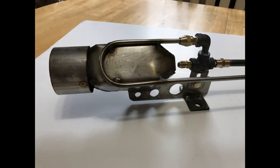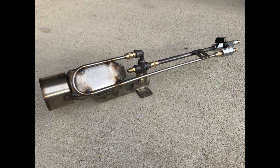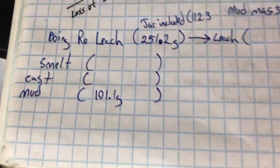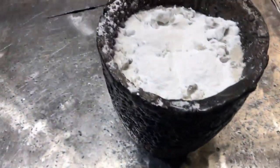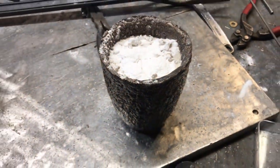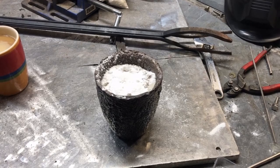What's going on fellas. What we're looking at right here is the hottest waste oil burner I sell — this is the Baby Godzilla with air preheat augmentation, to bring that temperature up and help burn some of the thicker dirtier oils. I'm going to be showing Basel how to build one of these, but we're going to be doing an e-waste melt with it first today, just to see how it does melting anode sludge. We have 101 grams of mud, it was dried and added to this crucible and we're getting ready to melt it. This stuff's going to be a little bit harder to melt than the shaker table material, so let's see how this goes.